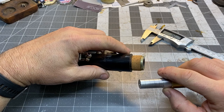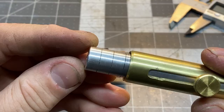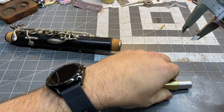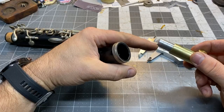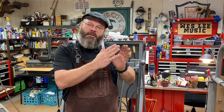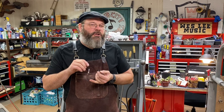That example was pretty straight ahead. Now I'm going to show you another one. If you have an upper joint that you're measuring and it is in between the lines — if we were to go down and lock this, we would see that this is in between. What happens in this situation: we measure our bore size, we measure where it is on the tool, and then we would take our reamer and ream it into the barrel until it was this size. You just use your calipers to make your measurements and make your marks. That's all there is to making the bore on the barrel and the upper joint match up. Take away these tips: small increments, light passes, go slow. Let the cutters do the work — you'll be golden. Check your measurements often.